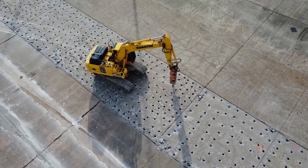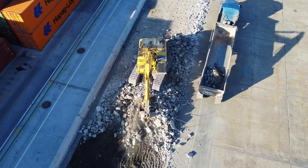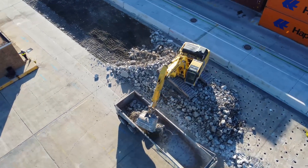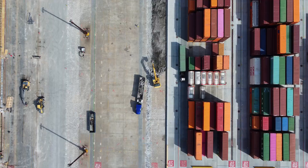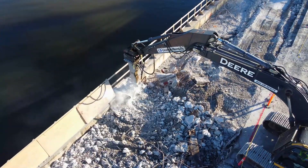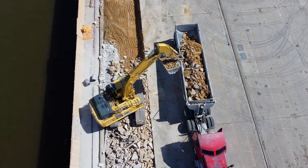Does it sound simple? Then let us start demolition. We will begin the demo process with two easy tasks. The first task is to get rid of the sacrificial deck. Excavators with jackhammers turn the existing pavement into chips, and then the pavement gets removed. Operators need to be careful not to damage the structural deck beneath the base layer as it gets removed. Jackhammers punch through the concrete and base layer effectively.